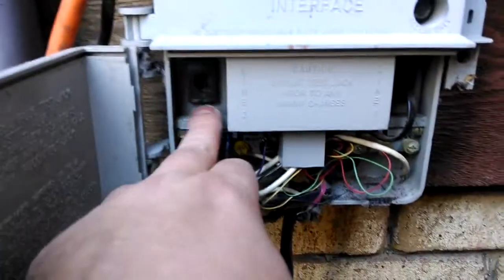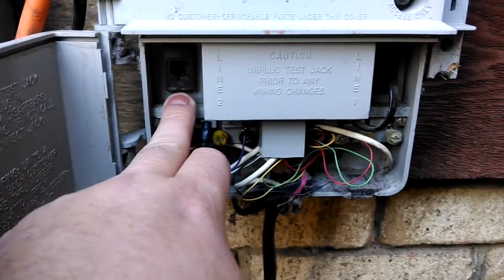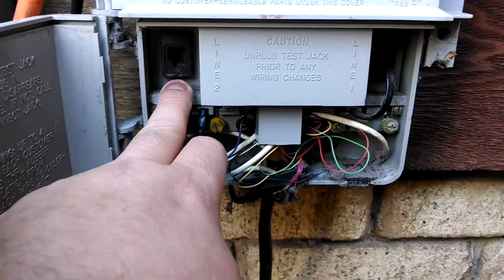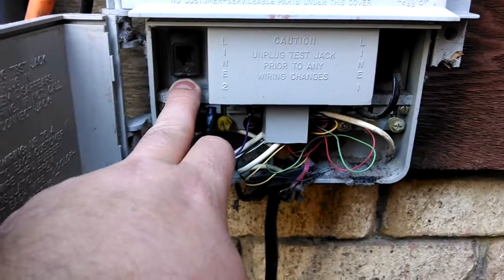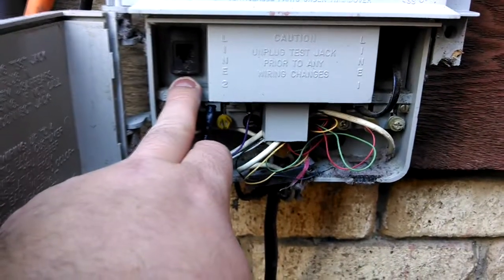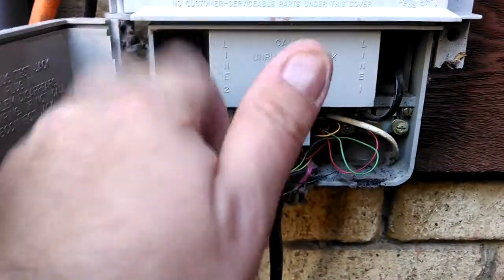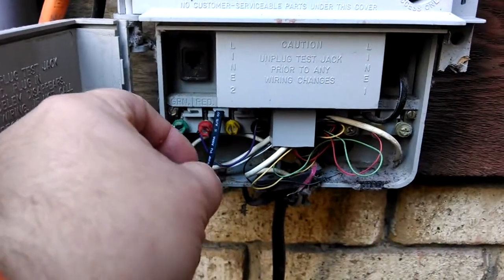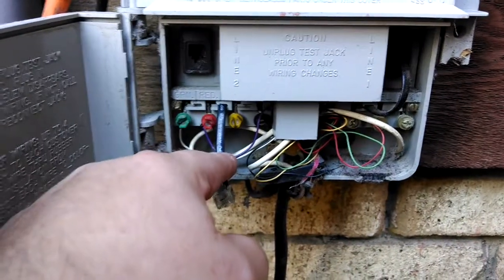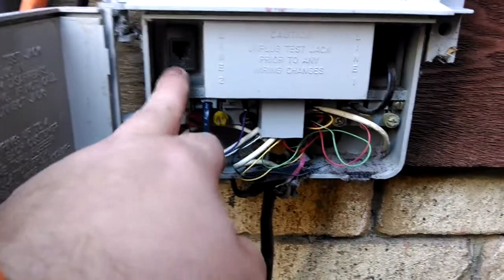So what we can do is plug a standard telephone into that and see whether the cables inside of your house are bad or whether it's just something going on outside. If it's inside your house, that is on your dime. All of the wires since 1984 inside of your house are your problem. But the good news is if you plug it in here and you're still getting the same problems you were getting before, that means it's outside. And outside is the province of your local telephone company, be it AT&T, BT, or DT, or whatever it is. Or AT&T, there you go, in this case.